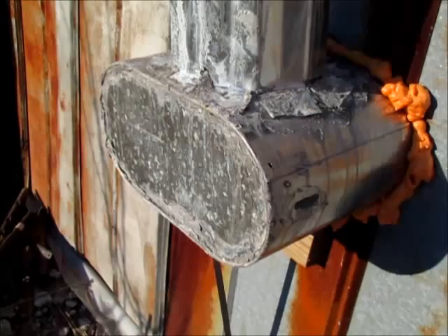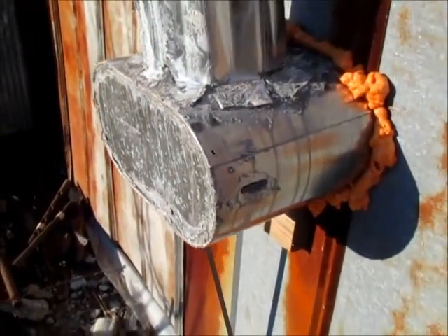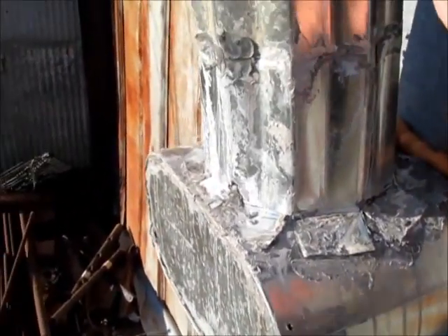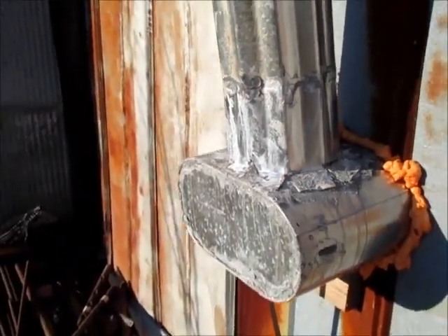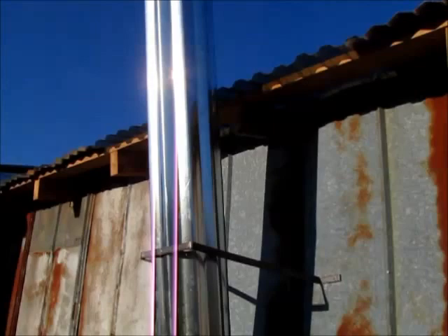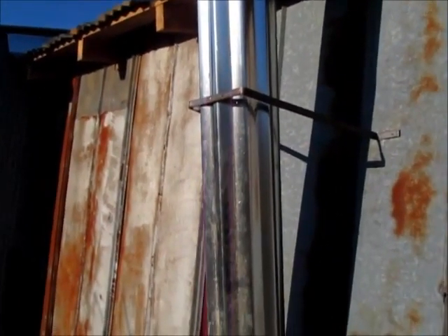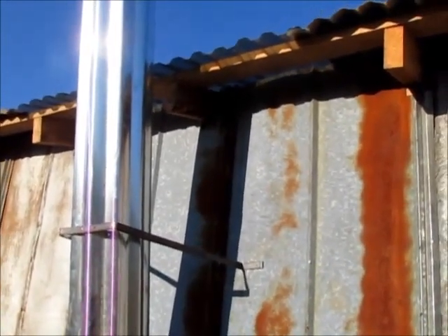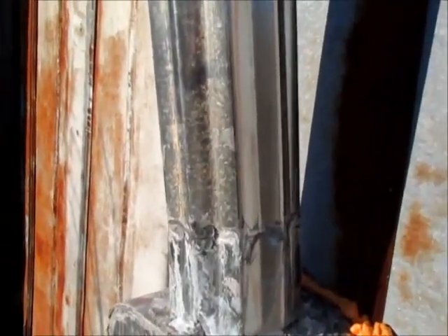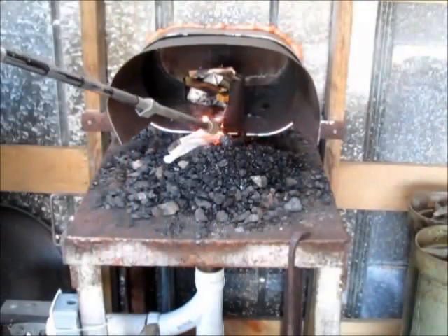There's my chimney — the rest of that stainless steel trash can is sticking out. I tried to seal up the cracks with fireplace cement, but it's kind of flicking off, and I capped off the galvanized section. I made the flue out of a piece of brand new tin I had left over — I just rolled it, riveted it, and caulked the seam with some fire-resistant caulking from Home Depot. It's about seven and a half inches in diameter and about a foot past the house — six feet total. It's outside the shop, so if anything carbonizes, it's outside.